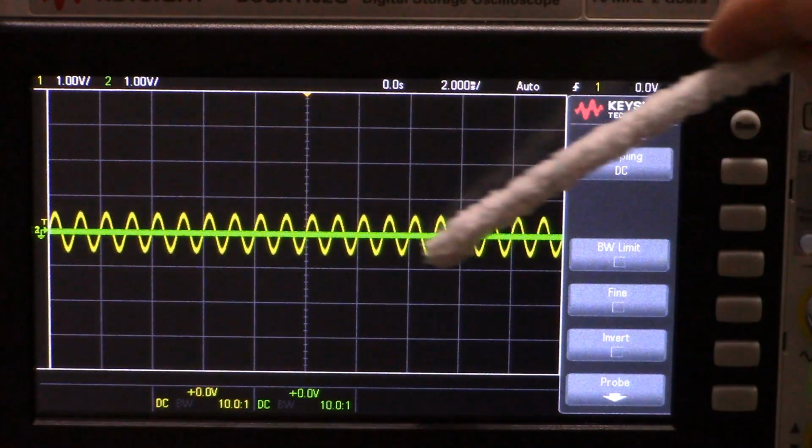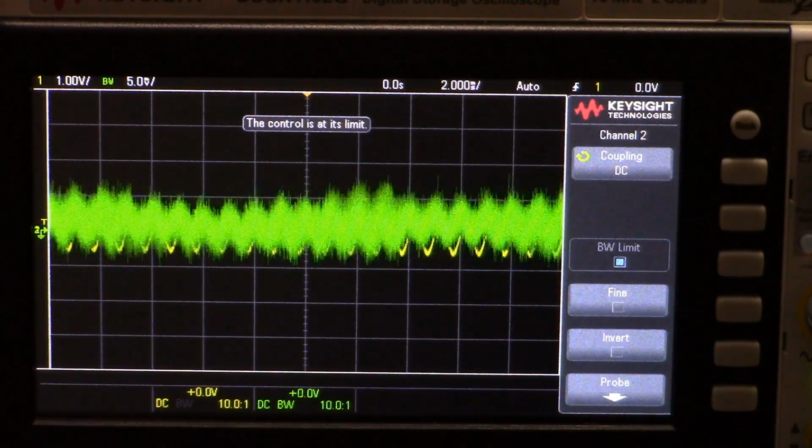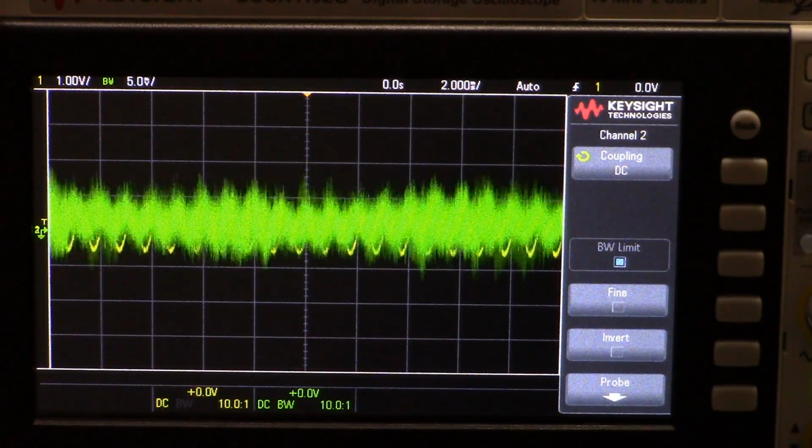Now, if I turn the gain down all the way, so now it's a horizontal line, at minimum volume and it's basically just a line. Let me change the input impedance now. You see, nothing's apparently happening. It is, of course. And if I increase the zoom, you've got an incredibly noisy signal, and if I change it now, hopefully you can see it's completely lost within the noise.